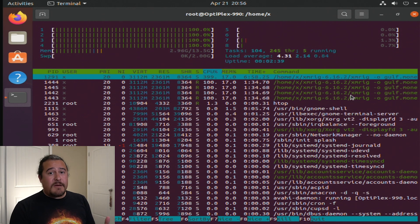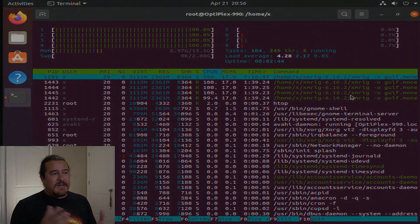So at this point we just let it be. Once it hits 5 p.m. it will shut down completely. Now in case you're wondering why I'm scheduling it from 9 a.m. to 5 p.m. instead of running it all day — like I said, I'm running it off solar panels, and solar panels don't charge batteries when there's no light. So I turn it on at 9 to give the solar panels time to give the batteries a little extra charge, and by the time the sun is fully out it's running 100%. At 5 the sun is still out but I want to shut it down so the batteries can recharge before night.